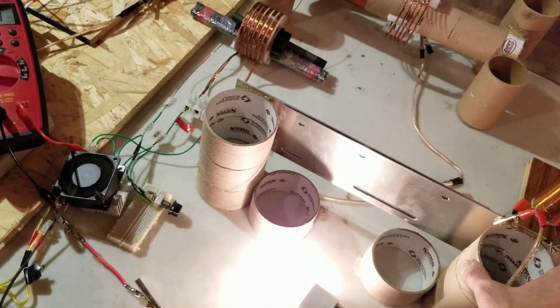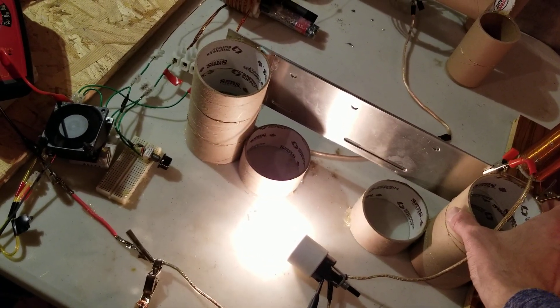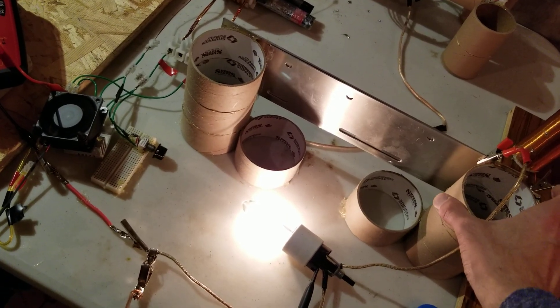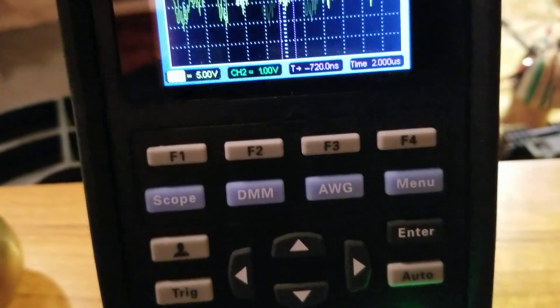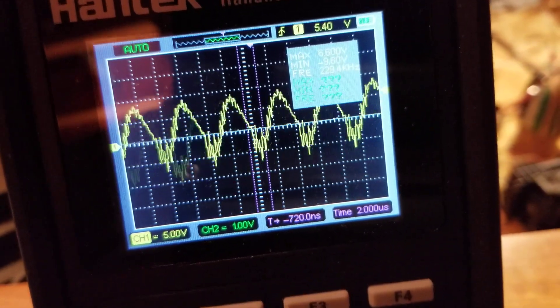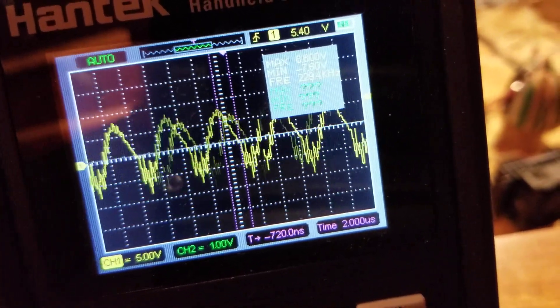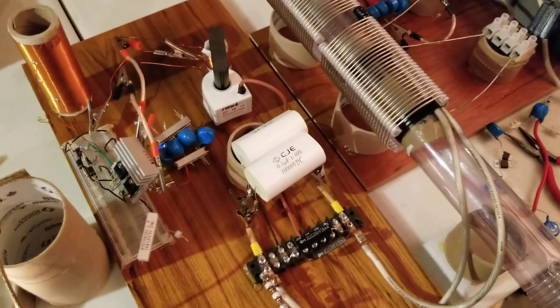It's kind of a perfect bubble where the light pops on. If I go with the plates really close, it draws a little less current, and the frequency kind of bounces between the low 220 kilohertz range. So this somehow could be an adjustable frequency driver for the input of the required 250 kilohertz to the primary here.